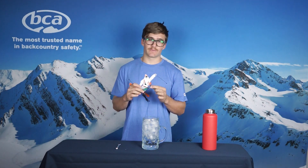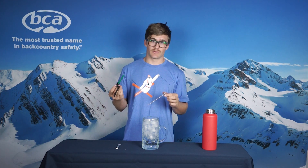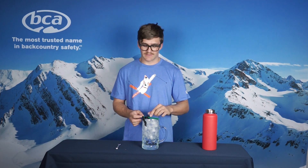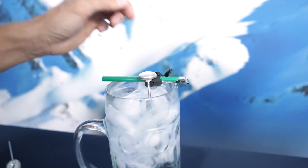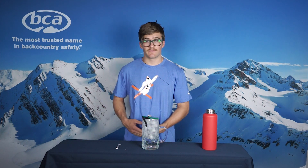We removed the thermometer from the sheath, and I find that this creates a great platform to hold the thermometer out of the water. You set it across and then balance the thermometer on there. We're being very careful not to touch the sides of the glass with the thermometer because that can corrupt your results. Now we wait for the thermometer to stabilize at whatever temperature it finds accurate. Ideally, it will reach 0 quite quickly, and you will know that your calibration is accurate.